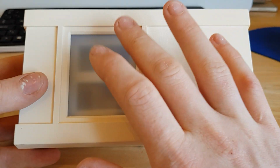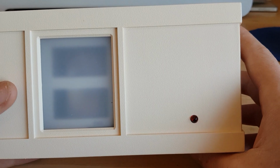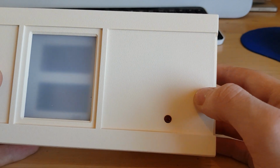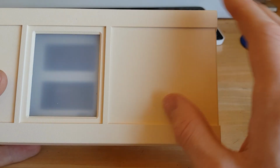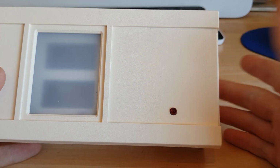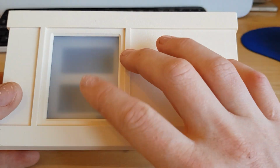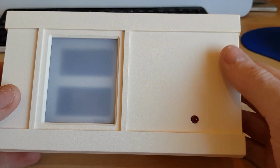I think that's probably the PIR part there, that massive lens. And unlike most Duotechs, well, in the 80s, things did look quite different to a modern conventional PIR. I mean, nowadays you get all these colour changing LEDs in them that are green, amber and red, and I know you can get a few PIRs that just have a red blinking alarm LED, but they're usually behind the lens. In the 80s, what you usually got was a red alarm LED, basically like this. You just got the LED sticking out from the casing, and that would just come on when motion was detected. And I like that method, because I don't really like the LEDs when they're behind the lens, because at night, well, it doesn't bother me, but it bothers other people, and if I'm doing an install, it's wary in my mind.